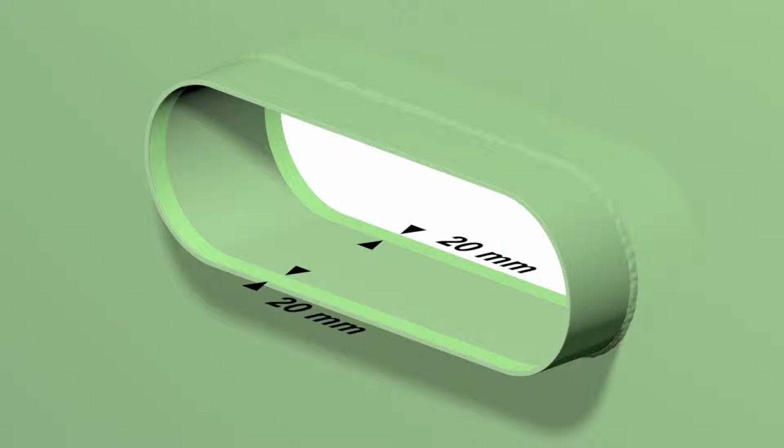In addition, any dirt, oil, grease, or other residues should be removed from the inside of the transit frame. Remember that a space of 20 mm at both ends of the collar must remain for applying the NOFIRNO sealant. Therefore, the sleeves are 40 mm shorter than the depth of the transit.